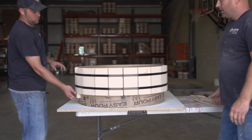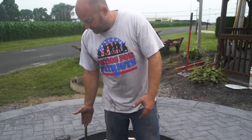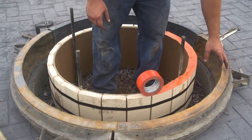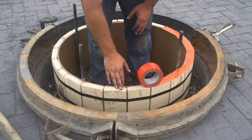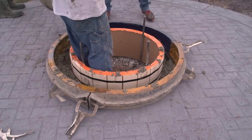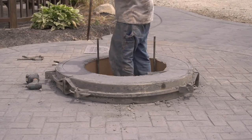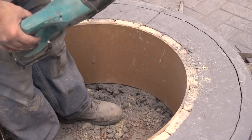Now we can pour this thing — this will be the top of the concrete and our other concrete will be out here. Now we're at the job site and we've got it actually installed here. All we're going to do is add some three-foot pins to help hold it up, and we put this fire ring around here with a rock face liner — the same rock face liner we're using on the rest of the patio. One thing I want to do is tape the top of this, so that when we're pouring with our color hardener and release agent, it doesn't get on the part of the fire brick that will be seen. The key to doing these fire pits is just filling it up evenly around there — we're just going to keep shoveling evenly around the whole thing. We can use a utility knife or a sawzall to cut the sonotube out once the concrete has set up enough.